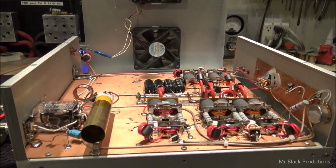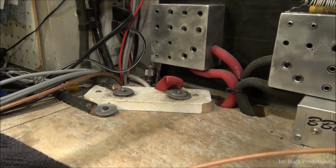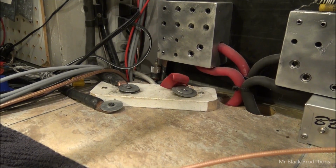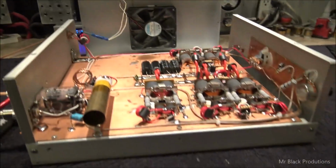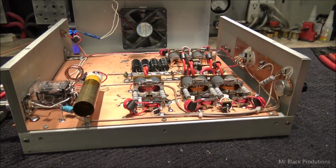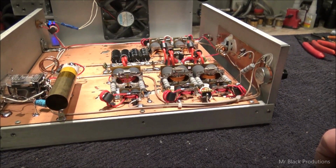And I was noticing that when I had it hooked up to my standard power tabs over here, it was losing current. I could see with the FLIR that those tabs are getting really hot, so I've got to go replace the screws, and I've got to make sure I've got good solder joints over there. Because going from there down to the 400 amp supply, I picked up 480 watts output power, so I'm losing some current there. Take that apart tomorrow and figure out what's going on. So anyhow, let's put the tin on it.